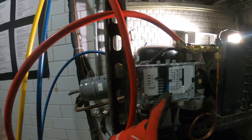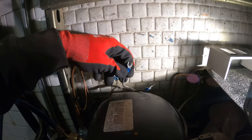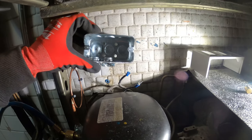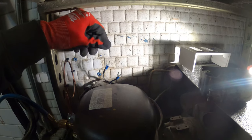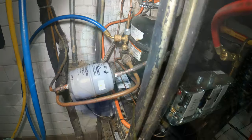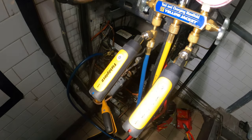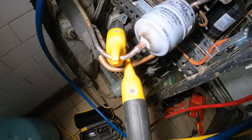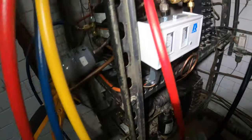We have to connect this here. I did make a video on what is a dual pressure control and how it works. I'm going to have to run some new wire — these connections are really bad here and I really just don't want to use wire nuts. So I'm thinking about mounting one of these boxes somewhere here. I'm going to run one cable into there, run these inside, and splice them inside the handy box. Here's the pressure control — I made my two connections with all these connectors, and I ran the orange cable along here and into that box. The wires are super short but it's just going to make it.